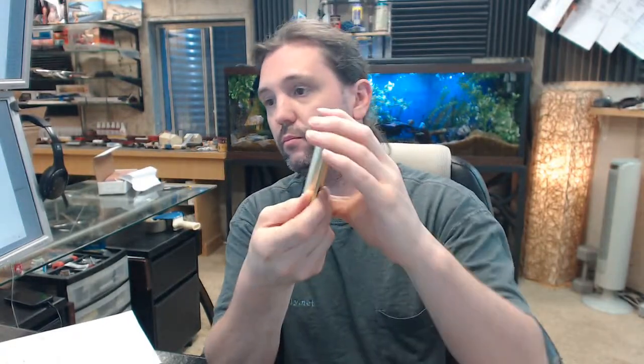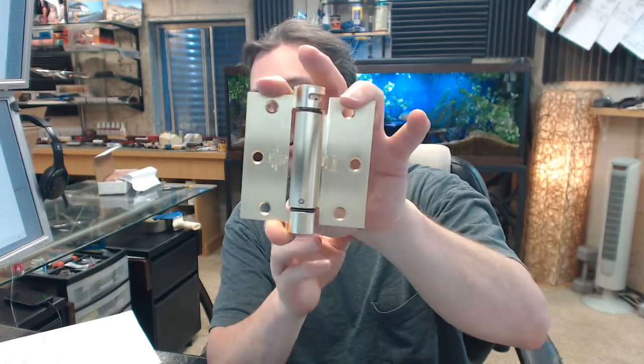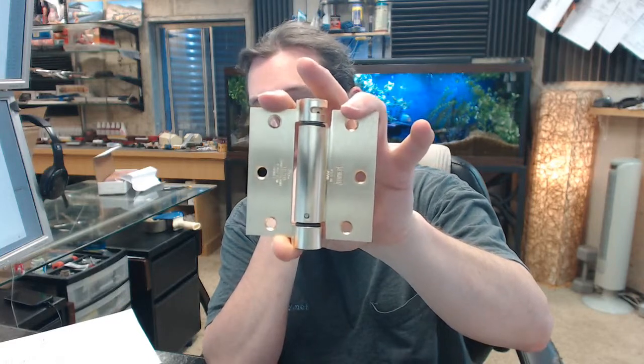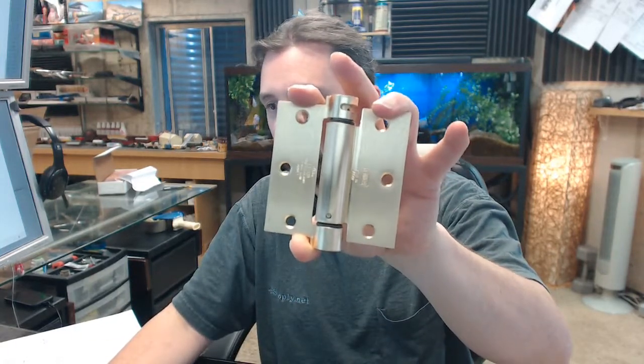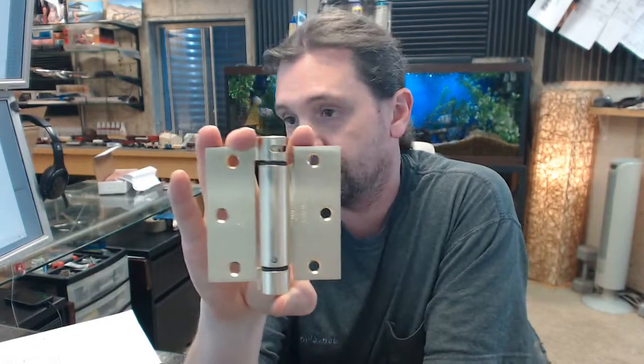This is single acting. It will close the door in only one direction. It's non-handed, can be used on left hand or right hand doors. Okay. UL listed for fire door applications. There is a link below this video to the template, and that template shows everything else important dimensionally about the hinge that I've not already covered. And specifically what you'll see are the locations of the screw holes, and you'll certainly want to refer to that template to be sure that if you're replacing an existing hinge, that this will work for you.